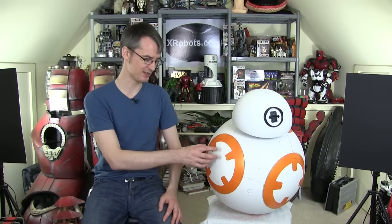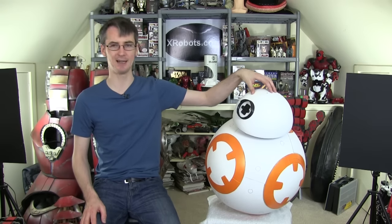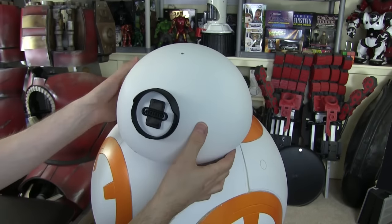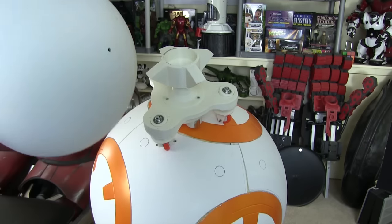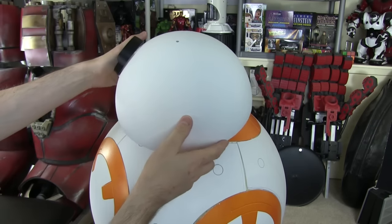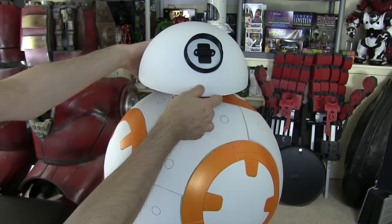Last time I said I was going to put slip rings on the internal hub so that I could put animatronics in some of these panels and LEDs in the ball, which is possible with this version. And in fact, I think what I want to do is get the head looking more like the head. There's a bit of a blank canvas at the moment, but that's going to involve electronics and lights. I think my head is a bit close to the ball at the moment, it needs to shift up a bit. I've put this hub in the middle here, which is solvent-welded to this ABS globe, which was an actual globe with countries on. I've got this dolly with a hole in the top, so this basically just sits on there, so I've got no problems putting an extension on that piece to raise it up very slightly to get that height correct.